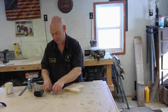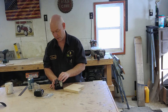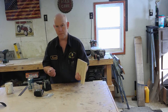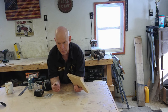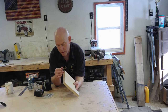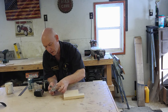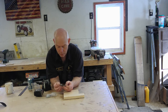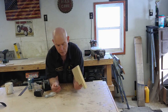I picked up a pack of six router bits from Menards — their Tool Shop brand, which is pretty much the cheapest of the cheap. This kit cost me nine bucks, so about a buck fifty a router bit. But they work for a while if you're not doing hundreds of passes all the time. Why spend $40 on one bit when you rarely use it? This board is seven-eighths inch stock and this is a five-eighths bit, so we can route a groove — hopefully without tearing up the edges. The keyhole slots are nine-sixteenths wide, so the five-eighths bit should work. I'll stick this in the router and route a groove, then we'll cut some patterns out of it.